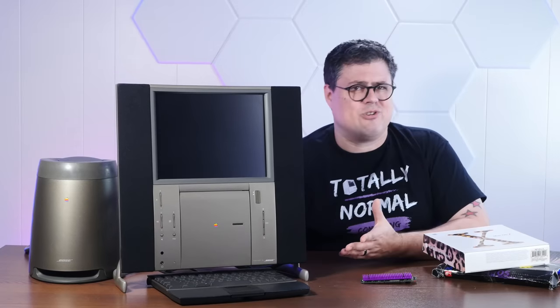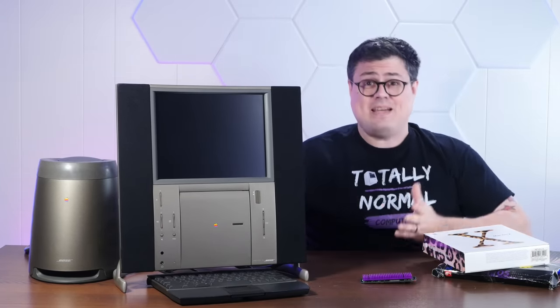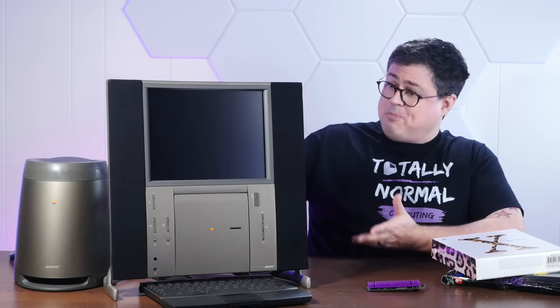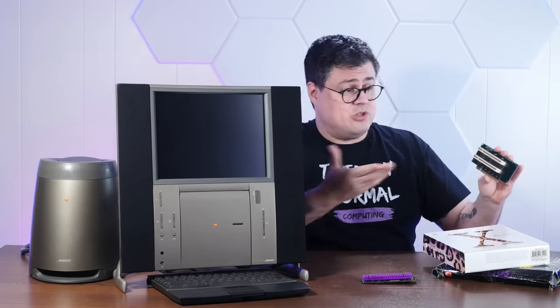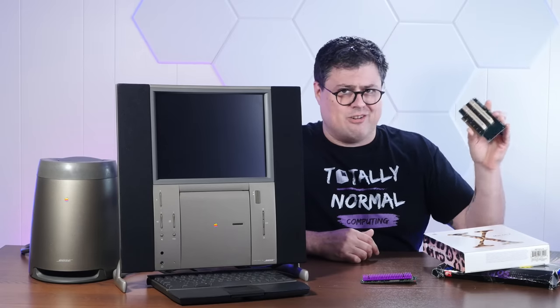You see, the 20th anniversary Macintosh, for as bespoke and futuristic as it looks, is basically a hodgepodge of 90s Macintosh desktop and PowerBook parts shoved into an interesting case. And although it was only officially upgradable using its single PCI slot and COM slot 2, in reality, you could shove upgrades in here meant for other Macs, especially the PowerMac 6500, which basically is this thing's logic board. You could fit the 6500's dual PCI riser card in there and it would work just fine, although it put a little too much pressure on the slot.